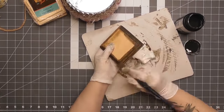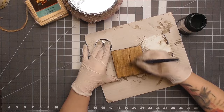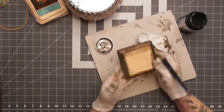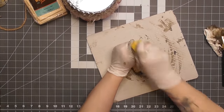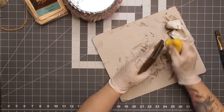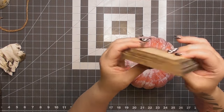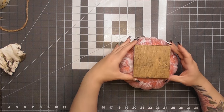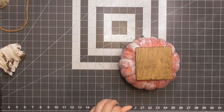Two sides of the wood plaque had a very rough cut and just soaked up the wood tint — really dark on those sides. So I put the tint all over, left the top as raw wood since you won't see it, and then used my little zip sander — a finger sander — to even out the darker sides. That's also in my Amazon shop under tools.